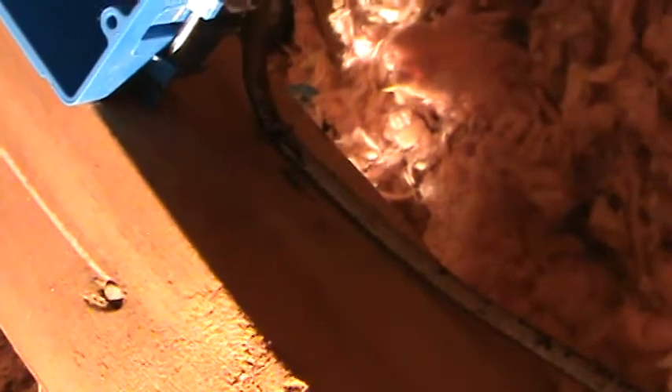The key is you just don't want to nail those staples in too tight. If you get it too tight you can kink your cable — I've seen it happen — and you could short out the circuit. All of a sudden you've got this short and every once in a while something happens and you're wondering what's going on; it's because one of those staples was in there too tight.